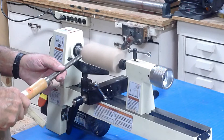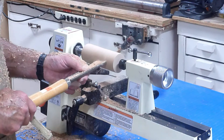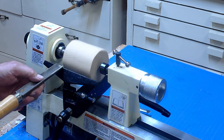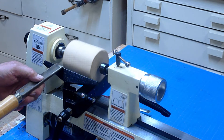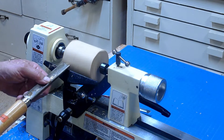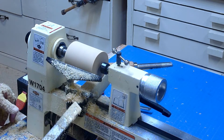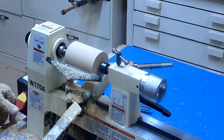Next I tried a two inch square piece of cherry, about the size you would need to turn a set of salt and pepper shakers. I used a variety of chisels on the test piece and had no problems with vibration, nor did the lathe slow down as I applied pressure with the chisel. Next I tried a three inch diameter piece of yellow pine — the same piece we demonstrated with earlier in the video, except I bobbed off the corners to make turning a little easier. I used the big gouge first, then switched to my skew. I had no real problem during the turning process, other than being too rough and using too much pressure, which chipped and gouged the piece. But the main point is that in spite of this treatment, the lathe was up to the challenge.